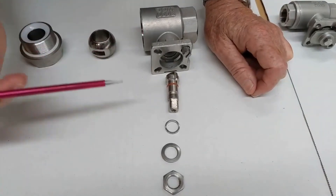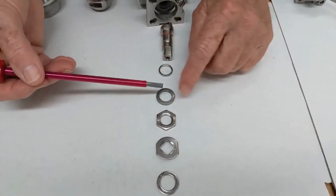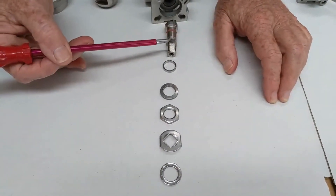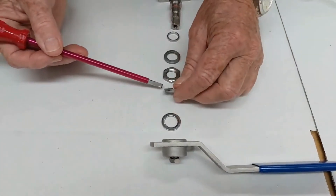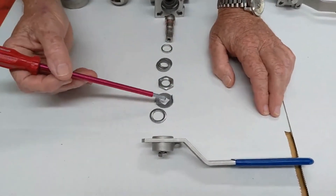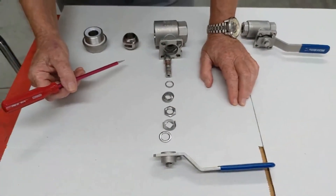On top of here we have the Belleville washers, which are conical shaped. They sit on this pattern against each other and are compressed down by the nut on the stem. Because of the Belleville shape they give a constant loading on the stem, so unlike normal packing the stem is loaded all the time. On top of the nut there is a locking member — it sits over the top of the nut and stops that nut from undoing. There's a washer at the top where the stem itself goes, with a little nut that bolts onto the top of the stem and holds the whole assembly together.